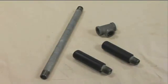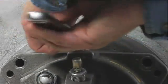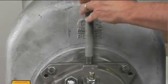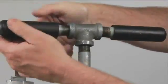If the tool is used, follow the instructions packed with it. To install the tool, remove the vented plug from the bearing housing and screw the longest length of pipe into the vent hole until fully engaged. Install the T and screw the handles into the T.